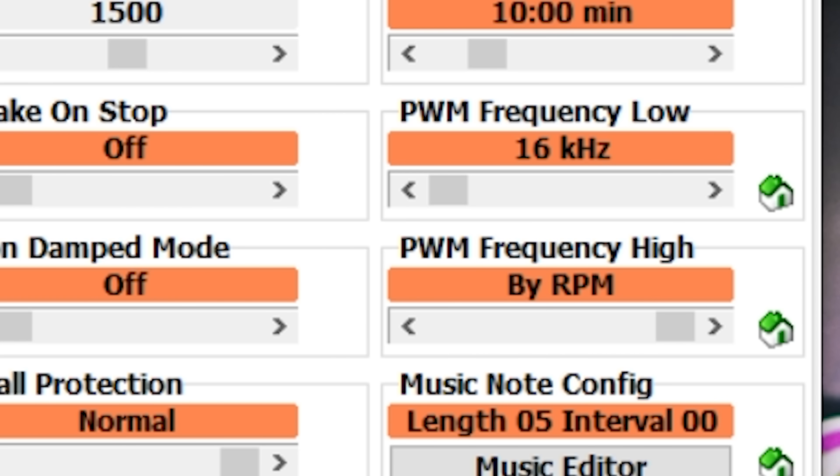This is the best performance you're going to get out of a BLHeli32 ESC today, but you need to be aware that not all ESCs will take full advantage of it. The By RPM feature gives you great smoothness, power and efficiency at the high end, great responsiveness and braking torque at the low end, and hopefully no mid-throttle oscillations throughout the whole throttle range. To fully take advantage of it, you need an ESC that can go all the way down to 16 or 24 kHz at the low end and up to 96 or even 128 kHz at the high end — my ESC only goes to 48K, which is not ideal.